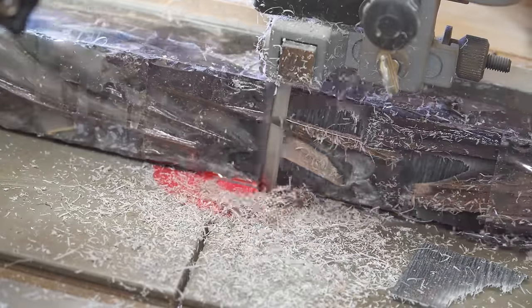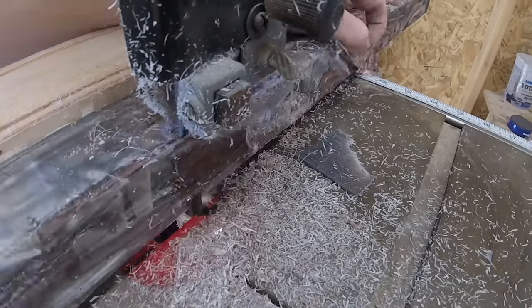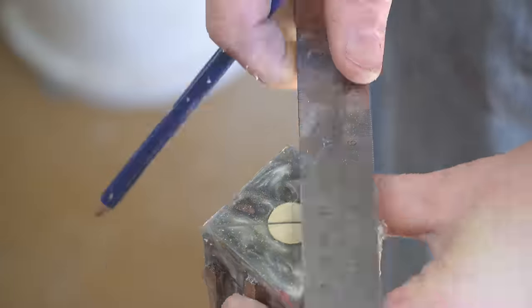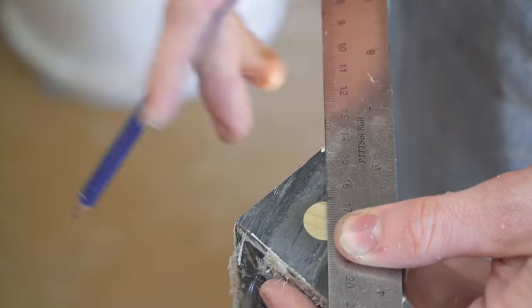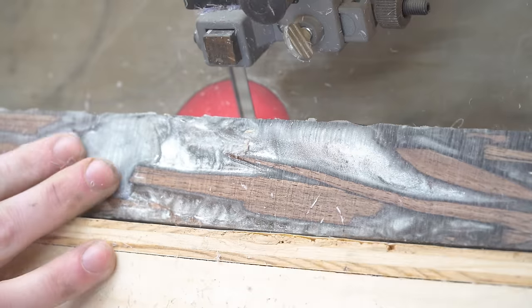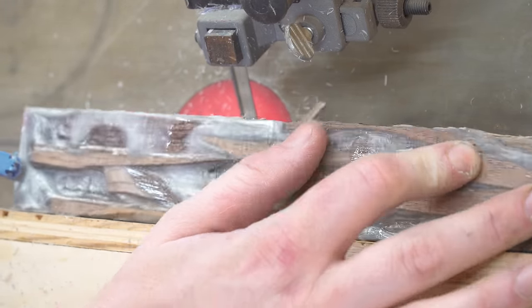The blank release is pretty easy. The top side of the blank was just a little high, which is normal with this process. So I used the bandsaw to square up the blank and then mark the center with the corner-to-corner technique. After that, one thing I really like to do is remove the corners on a square blank — in my opinion it makes turning to a rough cylinder much easier.